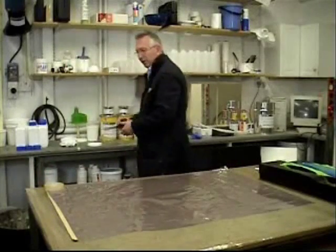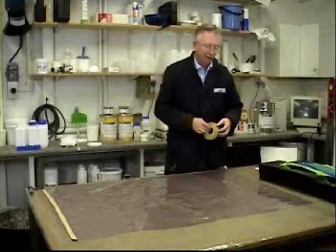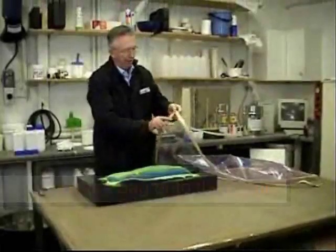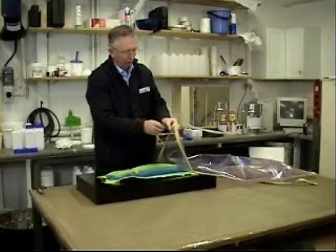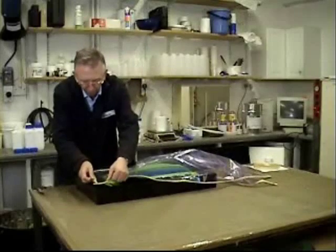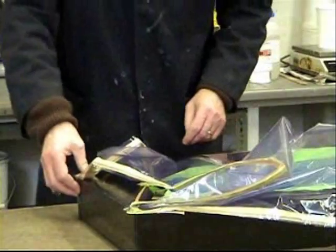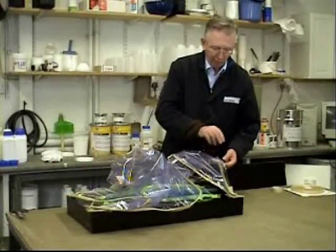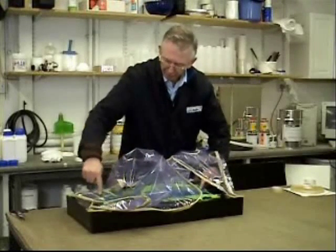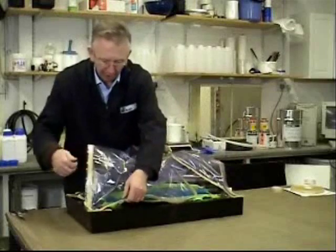Putting the tape on the bag enables you to make the necessary pleats so that the bag will fold up and compact the fabric more easily. Peel back just 50–75mm on each corner and fix the corner to the corner of the mould flanges and press down firmly. We've got all corners fixed, but on this shape we've got edges running along here, so we need to make some pleats to allow the bag to fold in — which is why we've got extra bag.